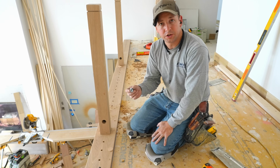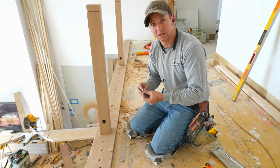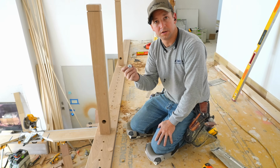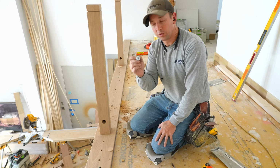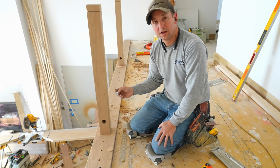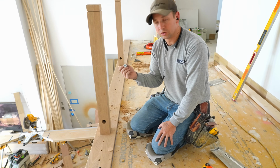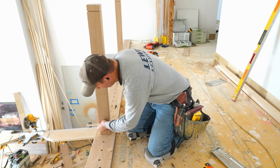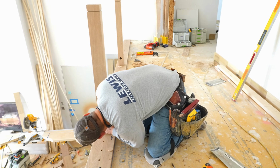Now, I actually should have checked this earlier before I put this hanger bolt into place, but it's a good idea to twist your nut on and make sure that the threads aren't damaged before you put it in. Because at this stage, if we go to put this nut in and the threads are damaged and we can't get this on, we're in trouble. I don't think that's going to happen. These are pretty high quality bolts with some massive threads on them, but it's worth checking.